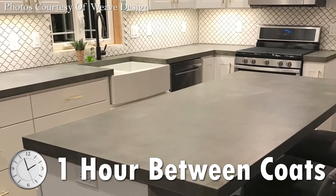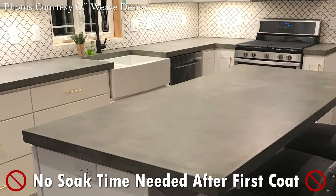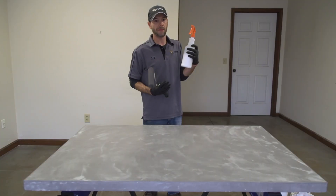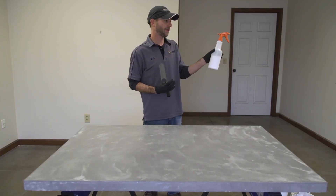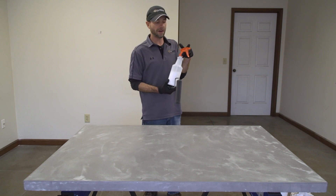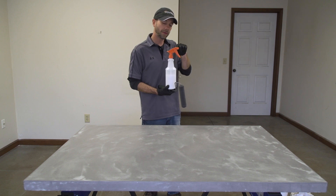The only difference with the next coat is that we're not going to worry about that five-minute soak-in period. I'm going to wait an hour, put another coat on, and give it another hour. This urethane is going to be fine in the bottle the entire time — all I'm going to do is pull my sprayer top off and run just a little bit of water through it to clean out the internals so it doesn't plug up in the next hour.